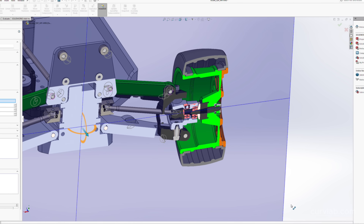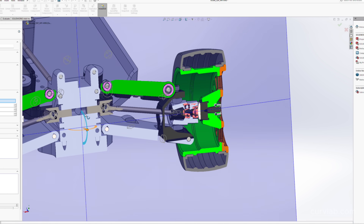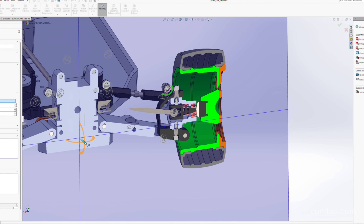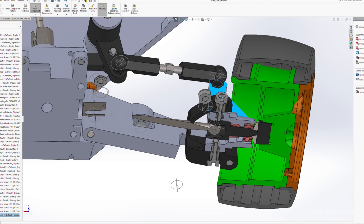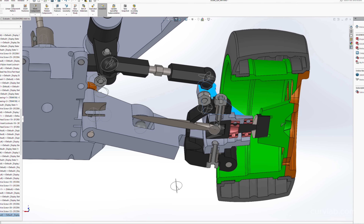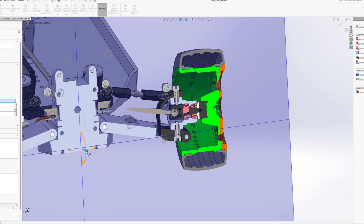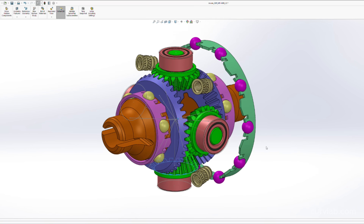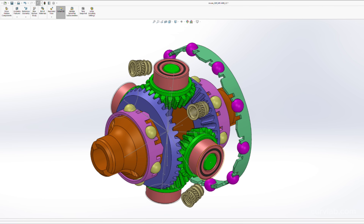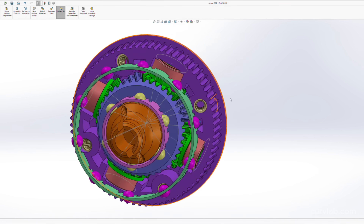I took a closer look to try and diagnose the issue. After some poking and prodding, I isolated the problem to too much tolerance in the bearings that press into the knuckle. Any extra wiggle room translates to multiple degrees of freedom of the wheel axle, which is not great for responsive steering and causes wheel chatter. I think the solution is going to be a simple one — just tighten up that tolerance for the next revision. So stay tuned for the next video.